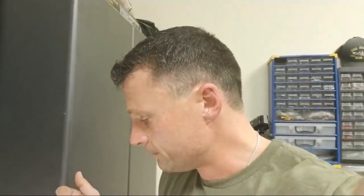I love it. I also utilize a lot of epoxy, 2-part epoxies. You're going to want that for more structural bonding of hull pieces together, or also bulkheads on the inside. Cool thing about epoxy, you can also thicken it with micro balloons. It can make a paste, so that could become a gap filler as well. I also use another Gorilla clear Gorilla Glue. It's a thick, creamy, clear adhesive that works really, really well. So I'm a big fan of those products.